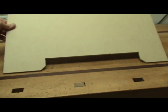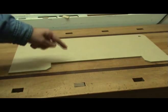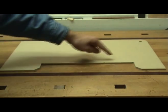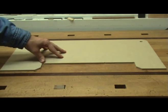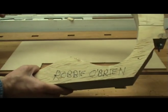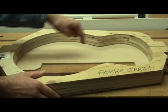Let me show you how to do that. You can get a quarter-inch MDF template blank from LMI, and I'll use this to make a template in order to make the bending mold that I need for my guitar size and shape. I'm going to transfer my custom shape onto this template. You can use a set of plans to do that, or in my case, I've already got an external form and I can place it on here to get the shape onto the template.